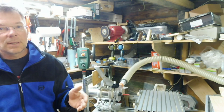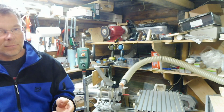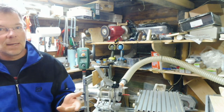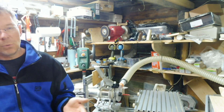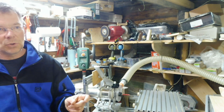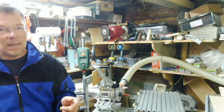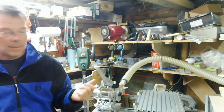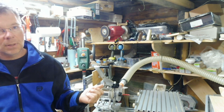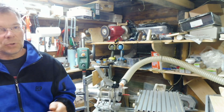So, what is the reason why I decided to go in this way? There are basically two reasons. First is that I'm from Europe, on 220 volts, and there are not too many router options, especially if you want to use a half-inch collet for the router bits. The second and main reason is that these CNC spindle motors are brushless motors, and this version is water-cooled, so they are extremely silent compared to the traditional router.